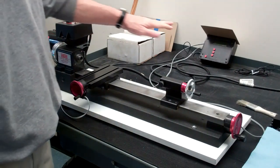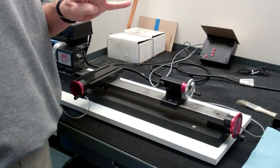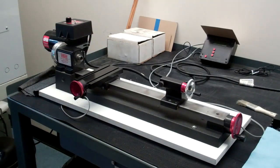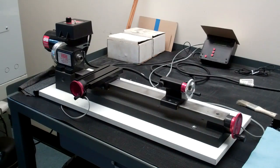On the X and Z axes, the readout reads out to four decimal places. In most cases you're just ignoring the fourth decimal place. When you get to some high-precision work — for instance when you're turning and trying to get a very precise result — you might use the fourth decimal place. Just be aware of that.